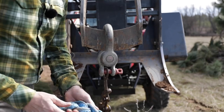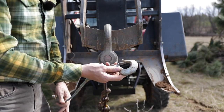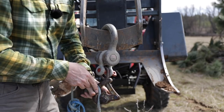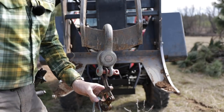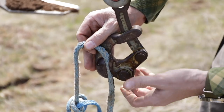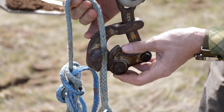What I've got here is a piece of this with a hook. The plan is: unclip it, lay it on the ground, pile branches on top, come back around when the pile is done, and short-hook it with the grappler or the little pincher that David sent. As we lift the bucket it will pinch — it's got a little pawl on it, and the heavier the load, the more it bites. That way we don't have to worry about tying knots.